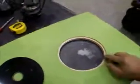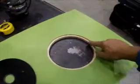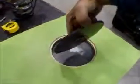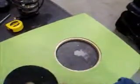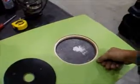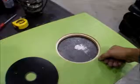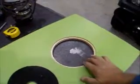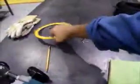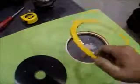Right where we put the screws here, we'll be routing this section away on both sides, and that'll allow the router to tip up and then drop through like that. And that works pretty good. My other router table's the same way, and I really liked it. So that's about it. It worked really well. I guess having that bottom template machined correctly is probably a big plus.